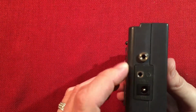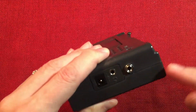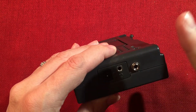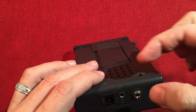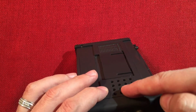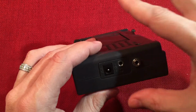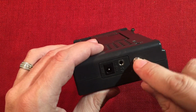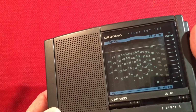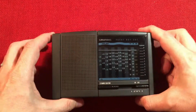If you get one of these radios and you're like, hey, I like that idea, I'll be honest with you, that's not for the faint of heart. To get this to work, you have to trim first the plastic on the inside tray, which is not too big a deal, but this extends pretty far and your PCB comes out over here. So I actually had to trim the PCB board to accommodate the jack, so when I closed it, I could do it in one action, so I could have the jack mounted as I closed it. So just keep that in mind. If you do want to perform this on a 207, you're going to have to modify your PCB board. So, well, there you go.